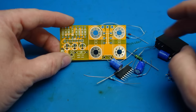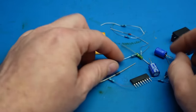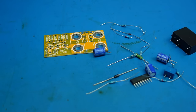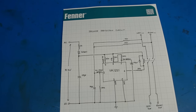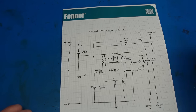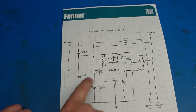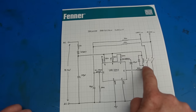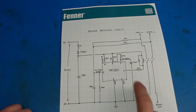Now it's time to fit the components onto this board. It very helpfully has got all the components labelled up really clearly, telling you what value they are - even marked on both sides. Good effort. So all the parts are here: a few capacitors, diodes, resistors - not a lot really. The circuit is quite simple, all built around this chip. We've got an AC input - it needs to be AC so it can pick up the power loss instantly. There's an AC detect, the audio inputs are picked up from the terminals, passed through a mixing network, and it just looks for DC offset. If there's a DC present big enough, it's going to shut this thing down - ultimately via this relay. There's an on-detect delay so when it turns on it charges a capacitor, gets to a threshold, then closes the relay.